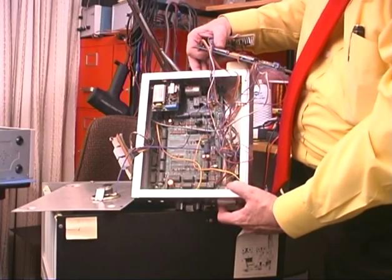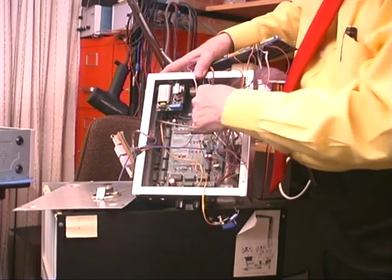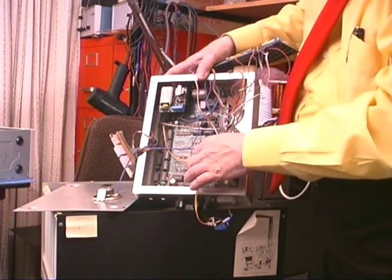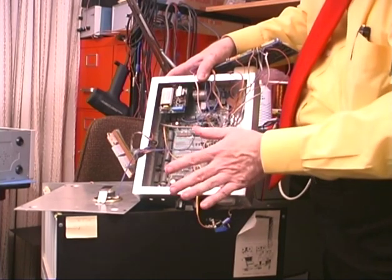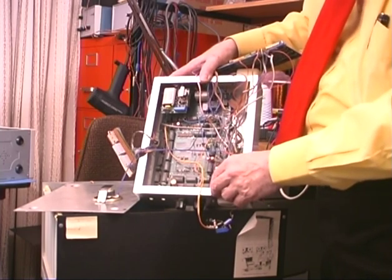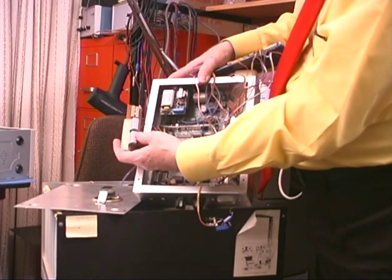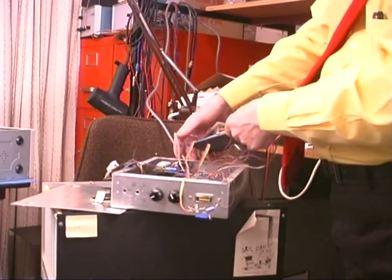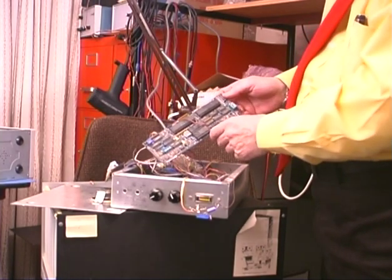Yeah, this modem really consists of 3 generations of modem hardware. The basic modem here is the one that I designed in Australia, and used in Australia. The tones were generated digitally, and I had all these diodes. I could change the position of the diodes to get different tones, because there were a number of different standards in use in the world at that time. There was a different standard in Australia, there's a different standard in the US. Later on I figured out a way of putting in these dip switches so I could switch between the Australian and US standards.